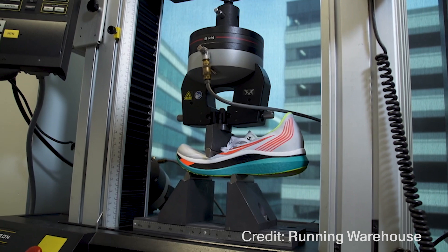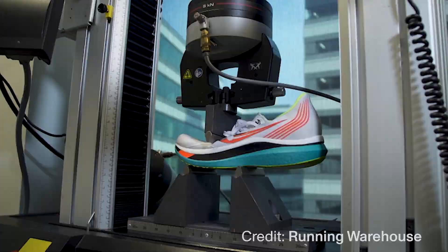When this first material crossed our desk, we did what we usually do when evaluating new foams at Saucony — we do mechanical testing. When we ran the first puck on our Instron machine, it came in at 95% energy efficiency. We had never seen a score this high before on any foam. I actually got our Instron machine recalibrated because I thought the result was a falsified error — we've never had a foam test this high. Come to find out there was nothing wrong with the machine. We hit a point with this new novel TPE-based material that truly brings something special to a shoe as honorable as the Elite 2.